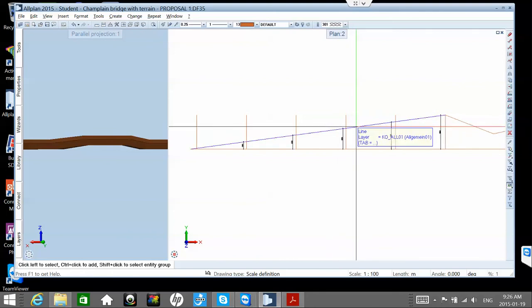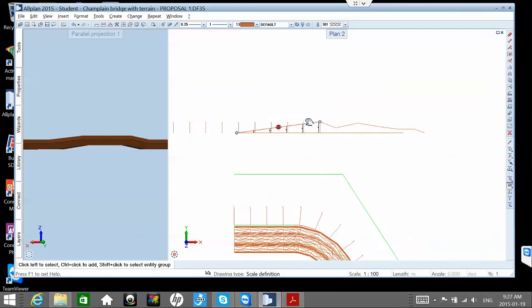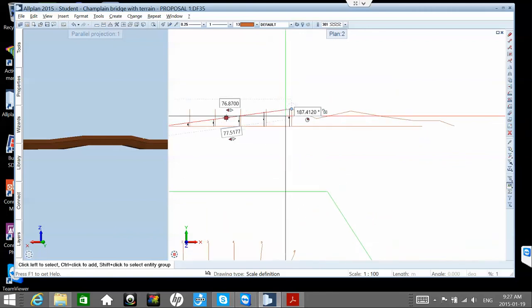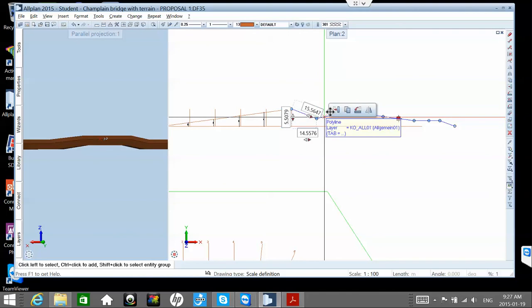So exactly as if drawing this 2D line, we can do it. We can export it and use this to become a line that defines the height of the bridge, and then let the bridge modeler combine them and create automatically, not changing each point manually. But we can do this if we had a 3D line, a 3D line that has also variation in plane. Because if we try to convert this profile into a 3D line, it won't create a digital terrain model as it's in plane itself.